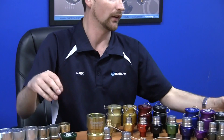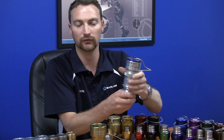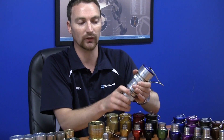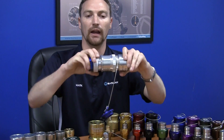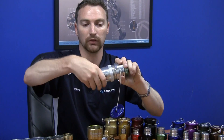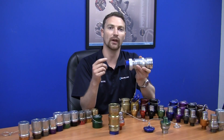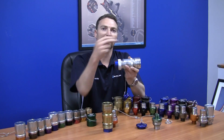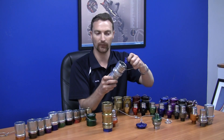We also have the BEC. It's got a few design features that the BEC-B does not have. It has a twist actuation valve so when you close it, it closes the valve internally and the pump will no longer withdraw any fluid through it. When you release it, you can undo the plug, connect it to the receiver, and if it's still not evacuating, you can twist the back end to initiate flow back through the coupling. The evacuation couplings can only be used to evacuate waste fluid — they cannot fill. It has a check valve in the back which prevents completely the cross-contamination of fluid back into the machines. You don't want to put a combination of waste oils back into the machines, so that's a very important feature of the evacuation couplings.